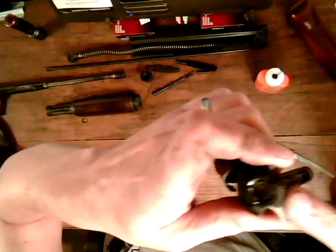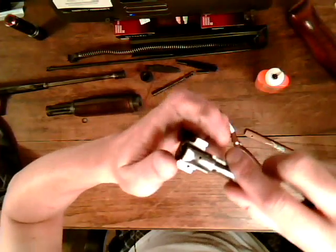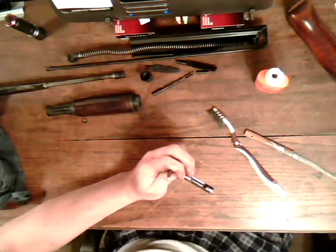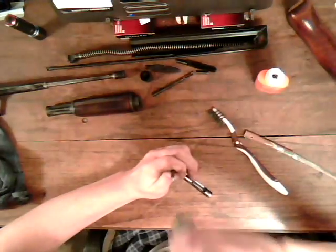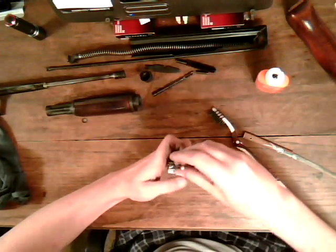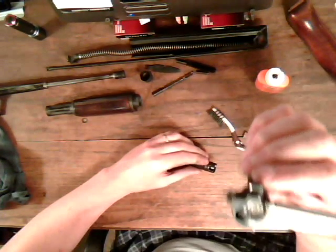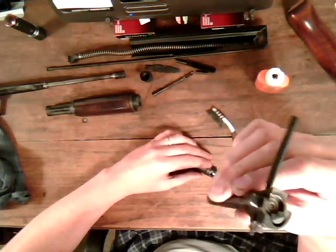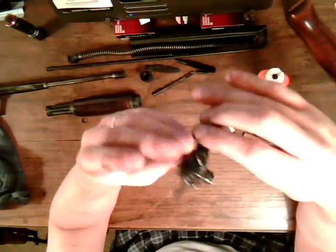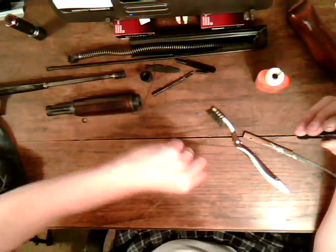This is the bottom of the bolt — the part that will catch the bullet and pull it out of the magazine and load it into the chamber. Put that right in there. This one takes a little bit of hammering. Now I've hammered that pin right out. You can see that the retaining pin is gone and now the punch is all the way through the bolt, and it is actually holding the firing pin in the bolt. The retainer pin is now in here.